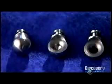This tool slices the swivel to the proper length. And then the partially finished swivel falls into a basket. Next, a drill works on the rounded tip, scooping out the center. And now you have a finished swivel.